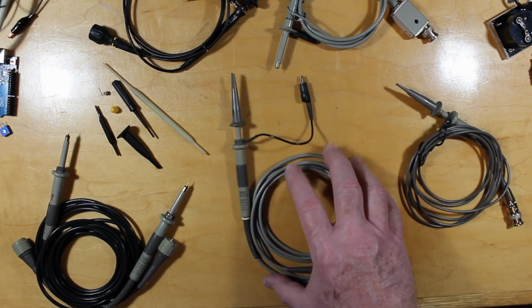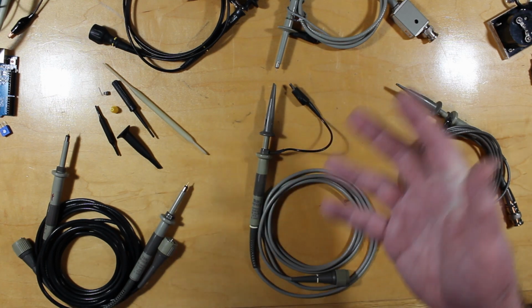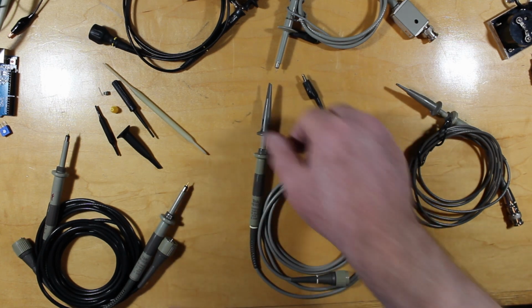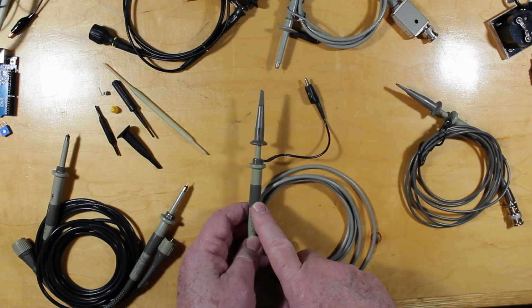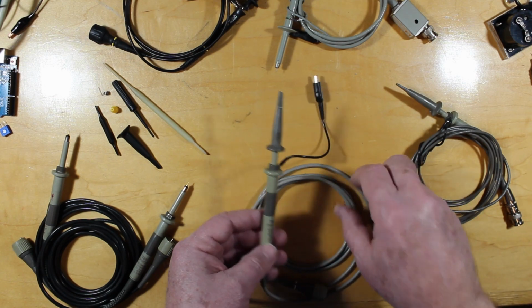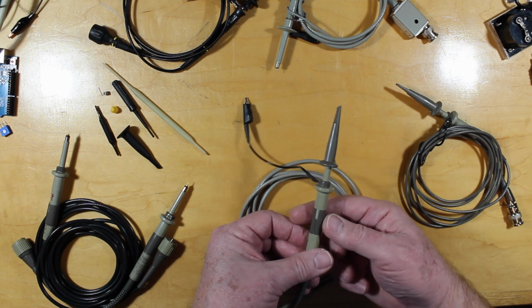If your scope is happy with this probe, and this probe adjusts to your scope, and your scope is 100 megahertz, basically you're going to be good to 50 megahertz with this guy. Now, the limiting factor is will this match the input capacitance of your oscilloscope? They have an adjustment on them, and that's underneath this cover right here that spins,